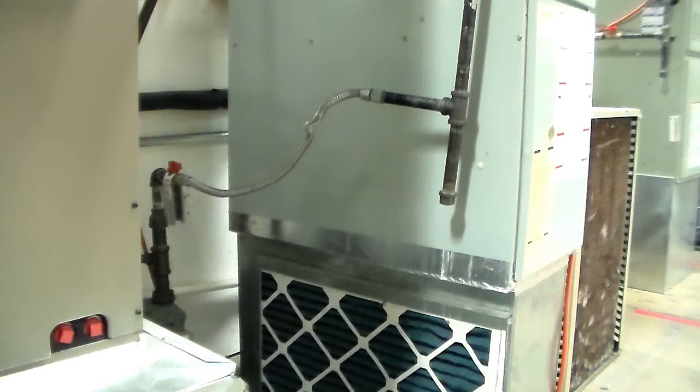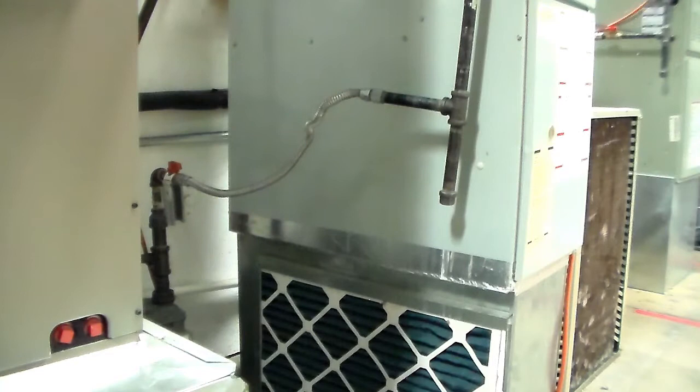Soaping the line — they'll ask you what you're going to soap and why. We're soaping the line to check for leaks; that's the why. What you're soaping is everything that you hooked up, messed with, or touched — but the key is that it wasn't already part of the pressure test or air test. So everything added or opened, like the line we opened when we purged and the pipe hooked into the furnace. You don't have to soap stuff that's already been air tested. Best answer: everything we messed with that wasn't part of the pressure test.